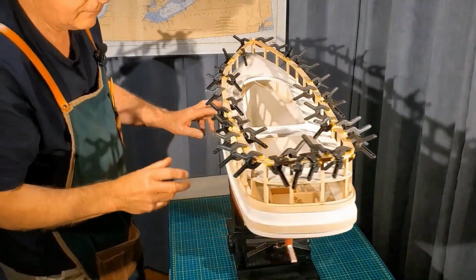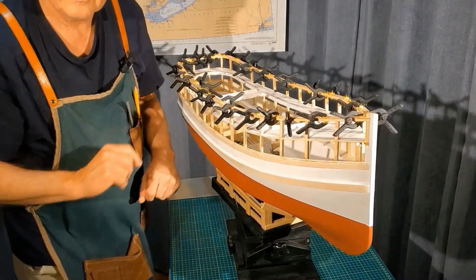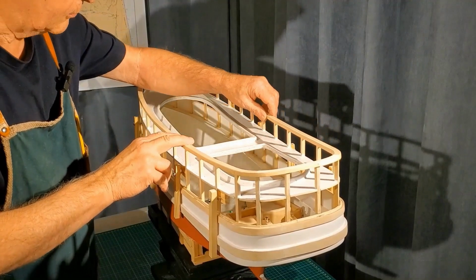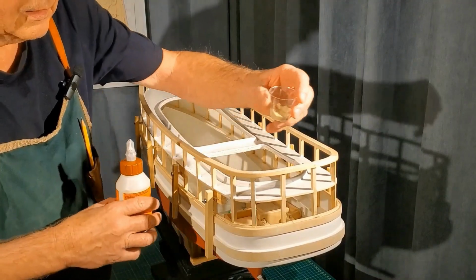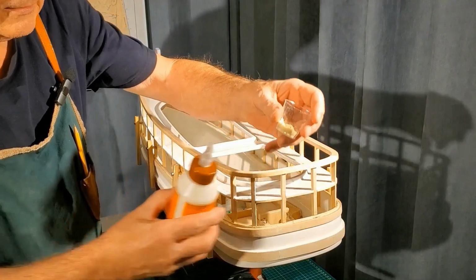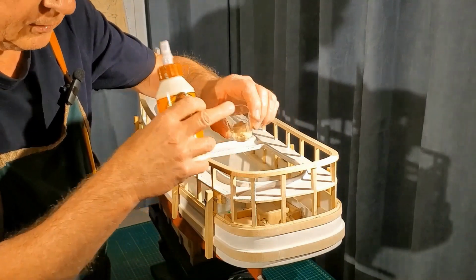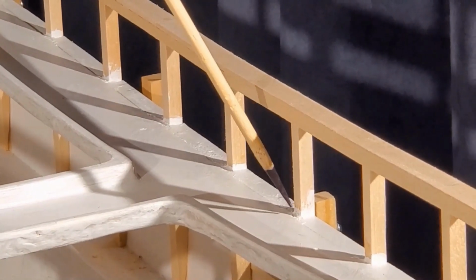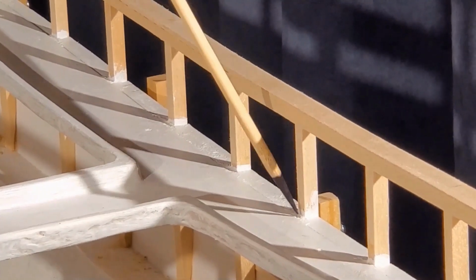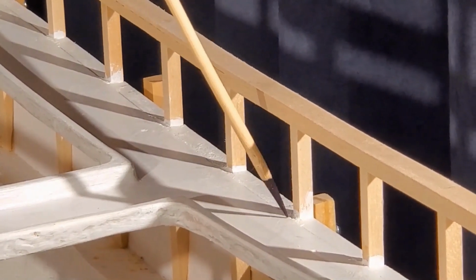All the clamps are set. We'll be able to sand that smooth tomorrow. So here's the handrail, all sanded smooth. I saved some of the fine sawdust from that job and added a bit of wood glue to it and mixed up kind of a paste. And I used it to fill some of these holes here. It's a lot less expensive than epoxy, and it certainly is strong enough.